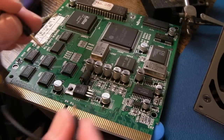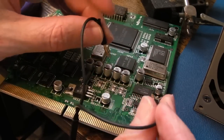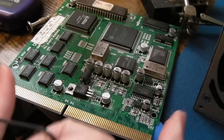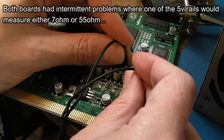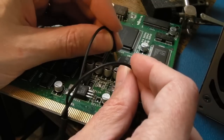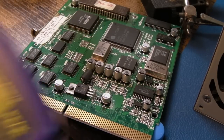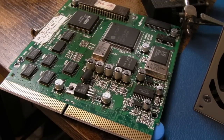This is what I get for working late at night when I'm so tired - I've swapped the caps on the wrong board! This is the board I was looking at - I fixed the cap there, but it hasn't made any difference to the sound. This cap here is showing seven ohms, which is a bit weird. I'll just test these three caps again with the LCR tester, because you can't really test ceramics with the ESR meter - that's designed for electrolytics and tantalums.